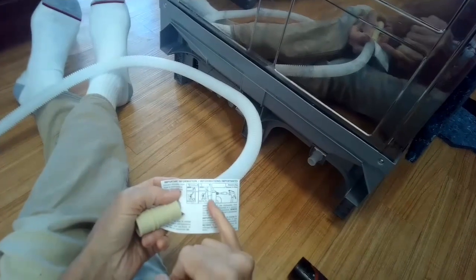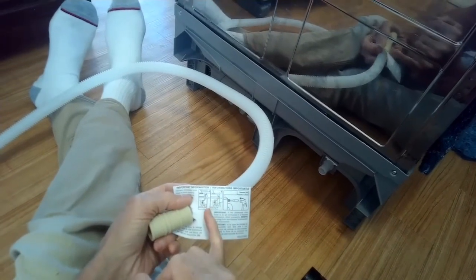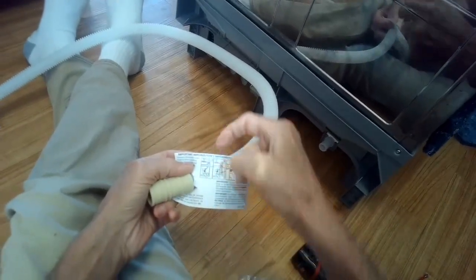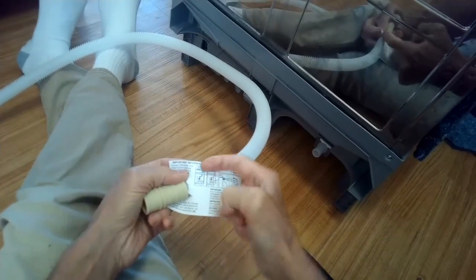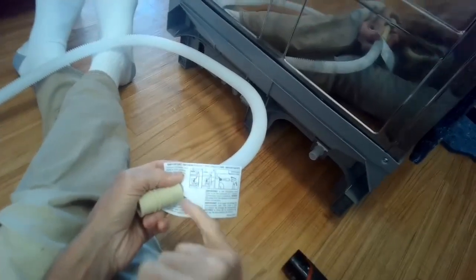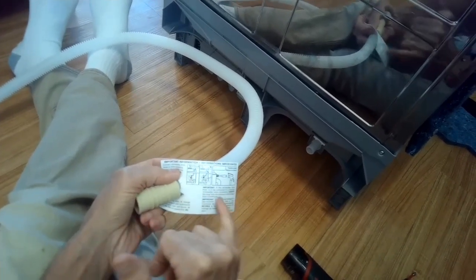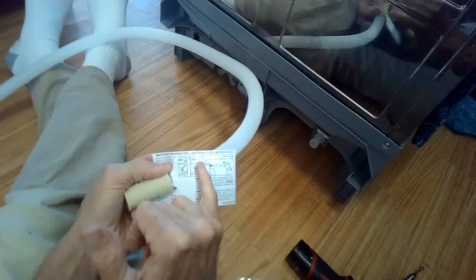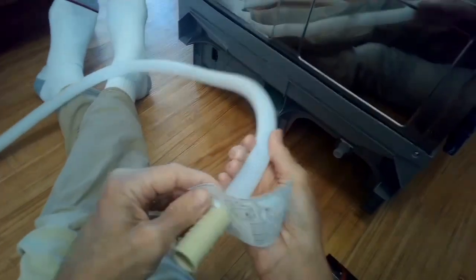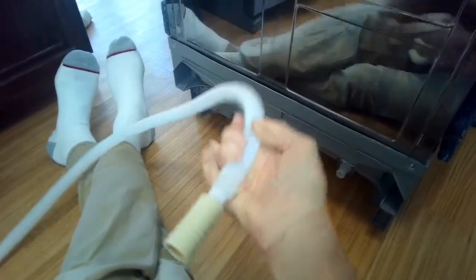It also talks about connecting this to an air gap fitting up by the kitchen sink. If you don't have an air gap, that's okay — you can just make sure the drain line goes through a high loop, as high up as you can get it into the underside of the sink, and then back down to the garbage disposal. That high loop is important because if water fills up the sink, it'll fill up the disposal, and without that loop the water will flow backwards and contaminate your dishwasher. So you either want the air gap or the high loop.